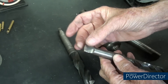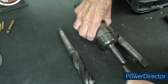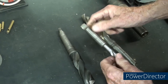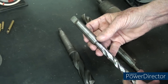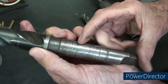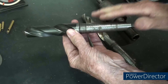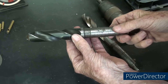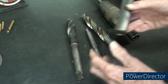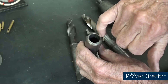I'm sure you've all seen damaged, twisted, or broken-off tangs on the end of drill bits. Here's an example — the tang is just plain broken off of this one. Often you see them twisted. I could not find any twisted ones in my collection, even though I have hundreds of these, because I tend to throw them away. What you will also see quite often is galling of the shank, caused because the drill spins in the quill, especially on the larger sizes — the torque is tremendous. Here on this Atlas lathe tailstock quill, it is quite galled up.